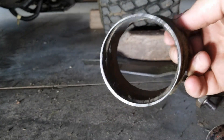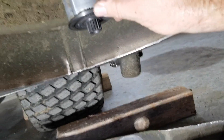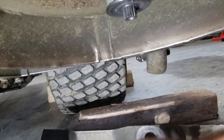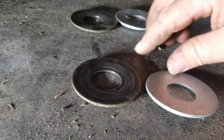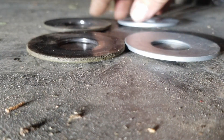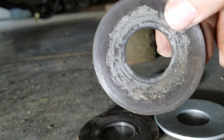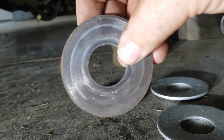Let's see if we can get that bolt off and take a look at those washers. The cup's broken — the bottom of the cup is gone. That may be why there's too much room in there. Comparing the washers to new ones, they're pretty flat. I can't really tell — well, that one's not completely flat. It's got some oxidation colors so they've been hot.